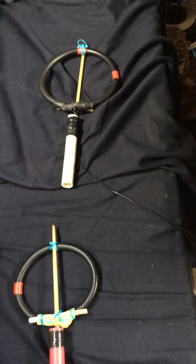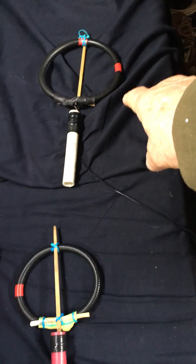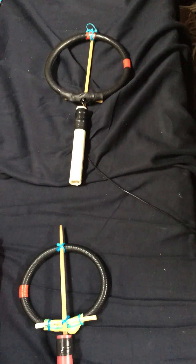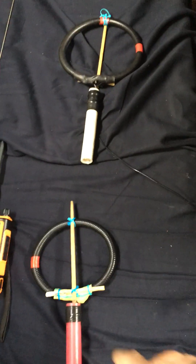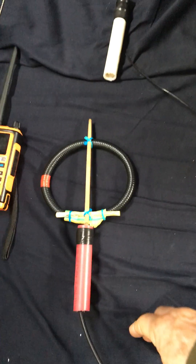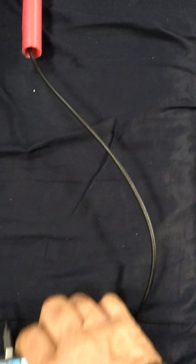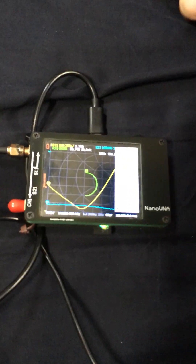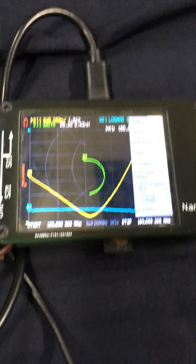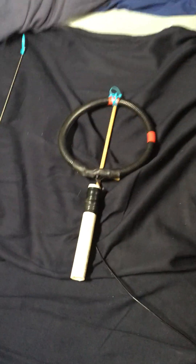These are two Russo antenna systems VHF magnetic loop antennas. This one is 146 megacycle two-meter ham band, and this one is 157 megacycle VHF marine. To verify they're operating in that frequency range, we hooked one up to our antenna analyzer, and there's the typical SWR curve for this antenna.